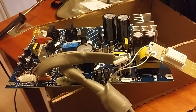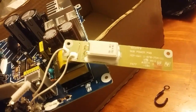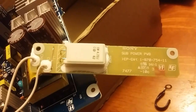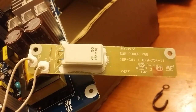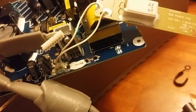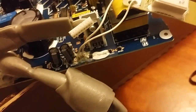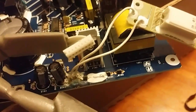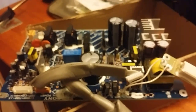I have two of these speakers. I bought them at the same time from eBay, years ago. I didn't make any modifications — this is from Sony. They had put in a 4.7 ohm, 5 watt external resistor in place of the R830. It didn't keep it from going bad, so here I am.